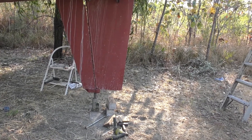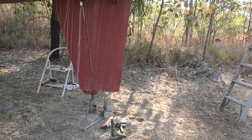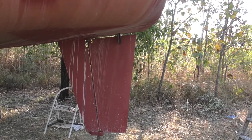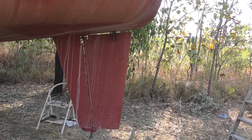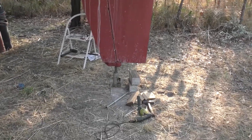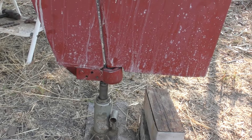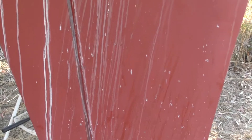It's been a pretty good day today overall. I've managed to get the rudder post welded up again and get some braces in place. I've got the rudder back on. I was a bit uncertain about alignment — it felt a bit tight when I first put it back on and put some bolts in. But once I got this bottom bearing cup back into place and got some pins and a bolt through it, it came up lovely — nice and free and moves easily.